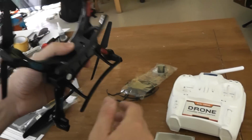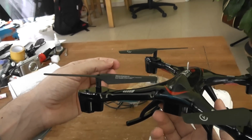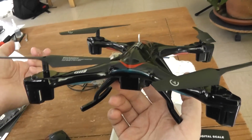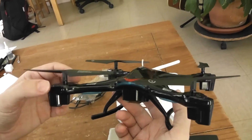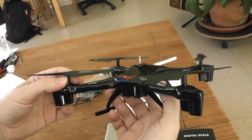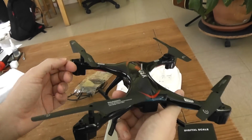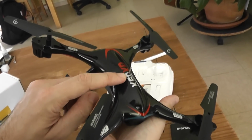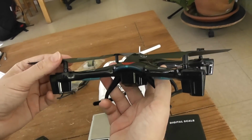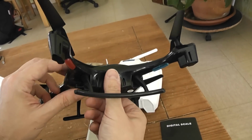Yes, that's all. Concerning the quadcopter, the protocol used is based on the XN297 RF chip. I tried to bind it with a lot of protocols I know, Cheerson, Blue, Green, some other ones with this same type of RF chip. I was not able. I immediately modded it to install the antenna vertically, so it's possible, and out of the box the range was pretty nice. So I expect something like more than 100 meters.